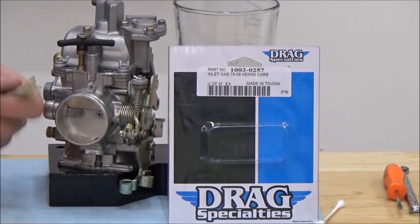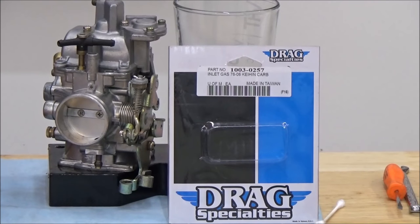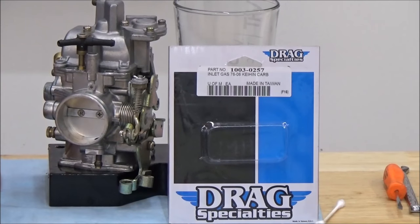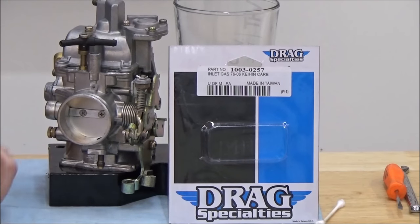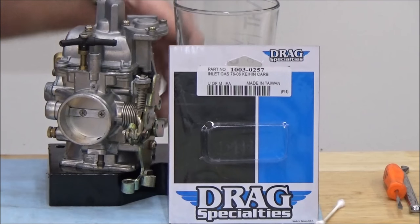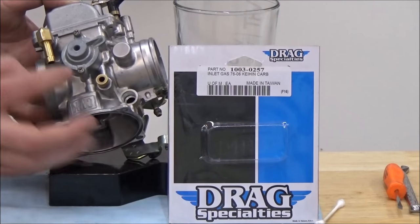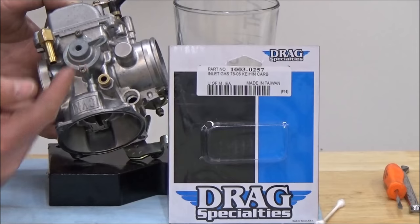You get this old plastic and once you've taken it on and off enough, it's going to crack or fatigue. I'm going to tell you where to find the part — Drag Specialties, our friends over there, you might know them through Parts Unlimited. It has a replacement fuel inlet nipple. It would be challenging for some people to install if you haven't dealt with interference fits before, especially because it has to be at a certain angle to clear the fuel line, air cleaner, and cutoff valve.